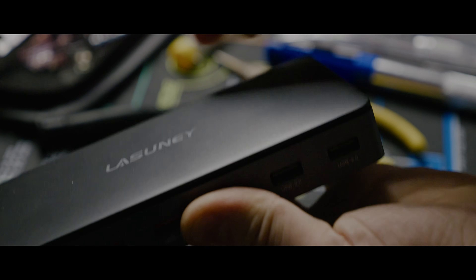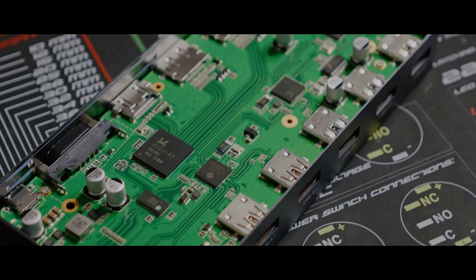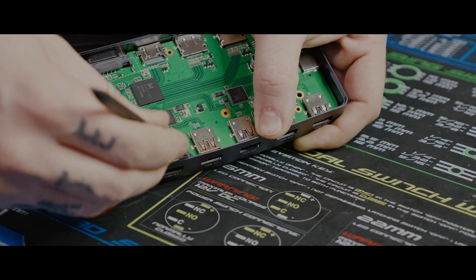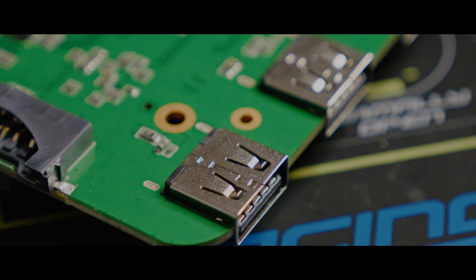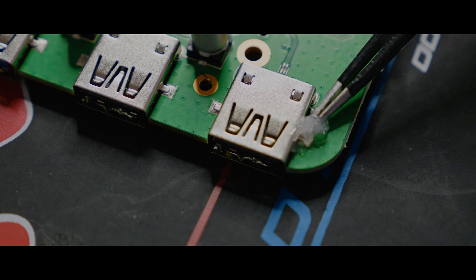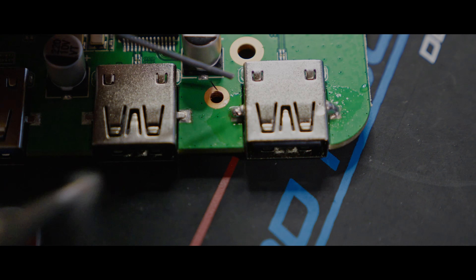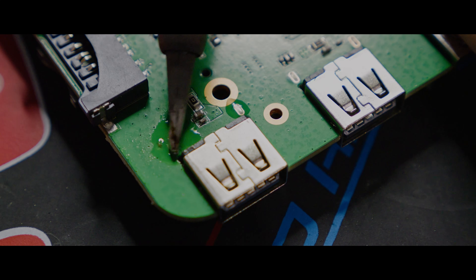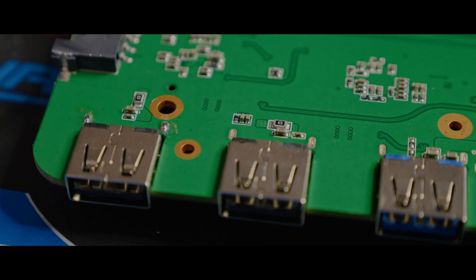You can remove the rubber feet from the bottom to expose the four Phillips screws. After removing these screws the top feels loose, so we can start prying along the edges to detach all the clips holding it in place. With the top removed we can see the PCB, four more Phillips screws, and then we can get the PCB out of the enclosure. With the PCB removed, a lot of the anchor points are not soldered all the way through, so we apply flux on the top and bottom and add more solder to make sure it melts all the way through the PCB down to the copper face on the bottom, creating a full solder plug through the PCB.